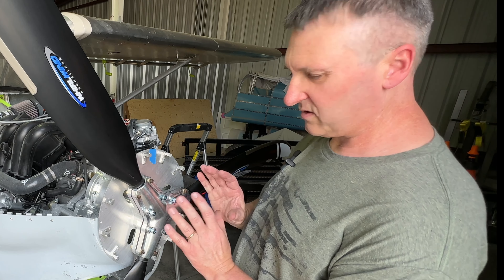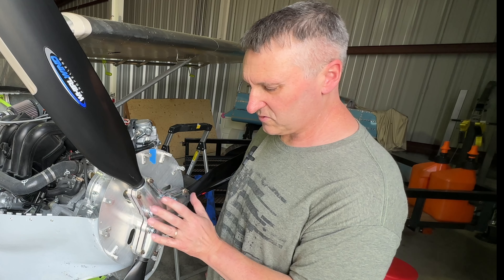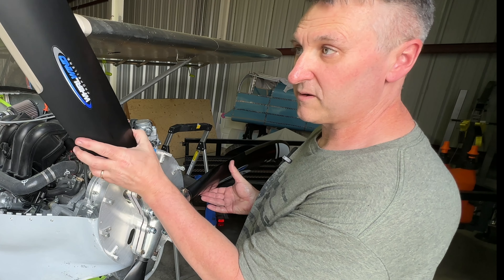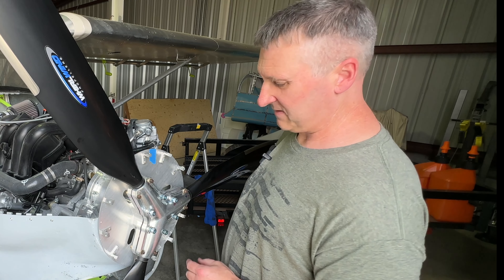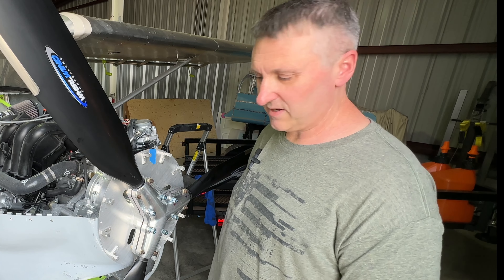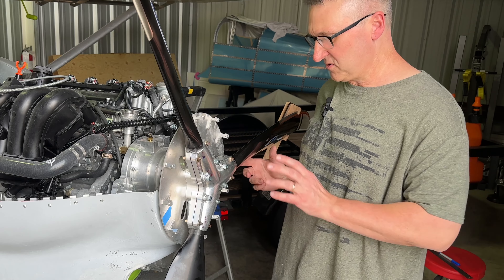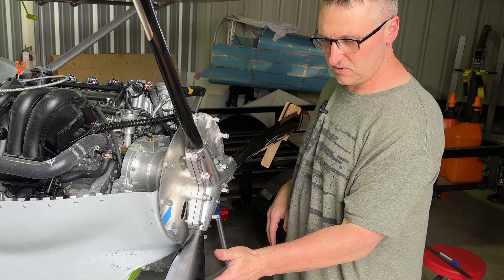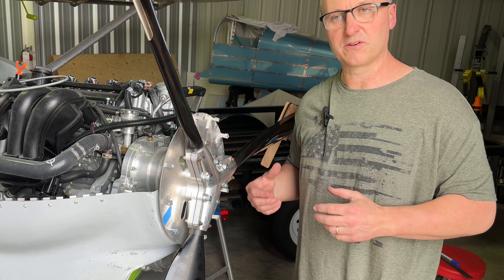So it took me a little while to figure that out. I went ahead and put anti-seize on each one — on all the threads, on all the bolts. They're in there loose right now. I'm going to tighten these up just a little bit where I can still move my propeller so I can try to get all three blades set to around 21 degrees. I'm going to shoot for 21 degrees starting out and leave that for my test run. If anybody has any suggestions, please let me know. I'm getting ready to tighten up my last propeller — got it at 21 degrees. I did the other two already. I used my phone as a video device and also as an angle finder to get my 21 degrees.